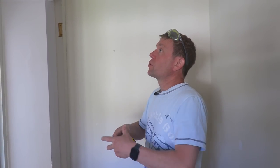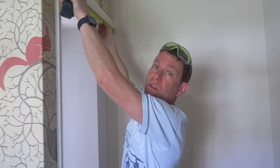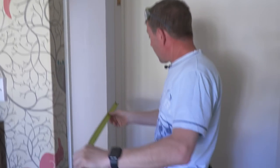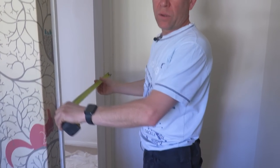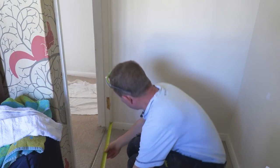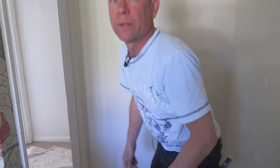I'm going to hang the door on here but at the top we've got 30 and 3 sixteenths. It's a 30 inch door. We've got 7.65 but in the middle we've got 7.74 - it's nearly 10 mil too big, so if I put the door in it's going to have a massive big joint. The bottom is the same - it's like 7.72 over 30 and a quarter, and we want it under 30 and a quarter for a nice joint.